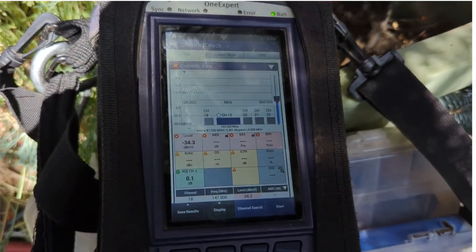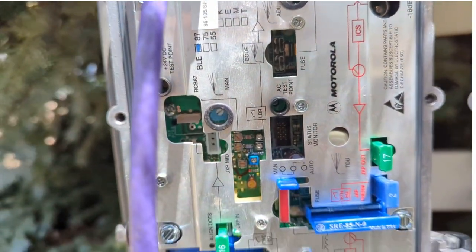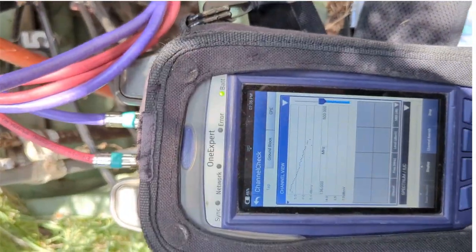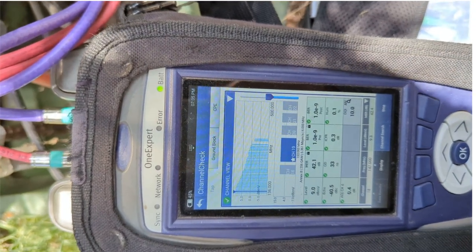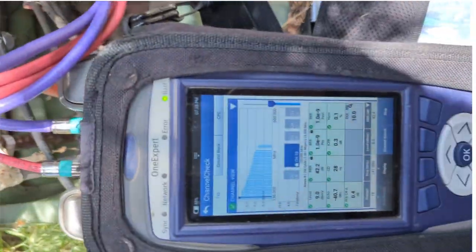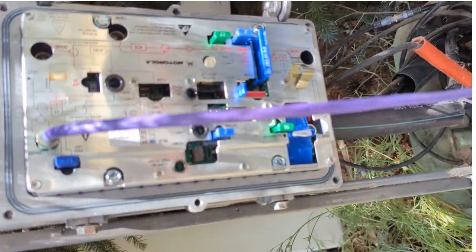Okay, we've got absolutely nothing on the high end. I think we forgot our mid-stage pad. Looks like adding that mid-stage pad helped — we still have a nasty reverse tilt we're going to have to address, but we've got our signal. I just need the equalizers to correct it. What I want to see coming out of that port is 20 dB down, so we're adding 20 to it — I usually want to see about 35. We're going to take away a little padding.